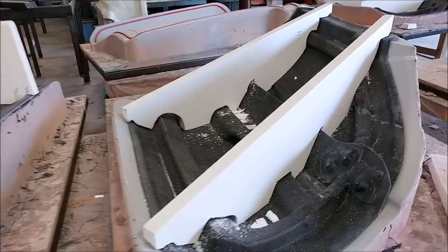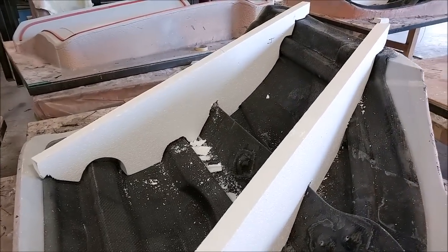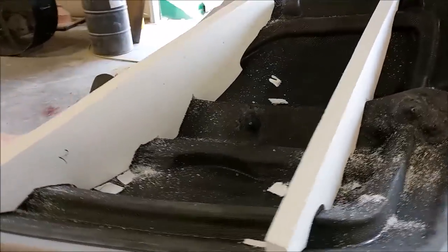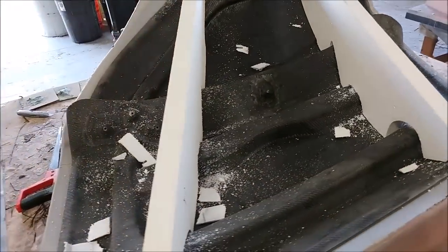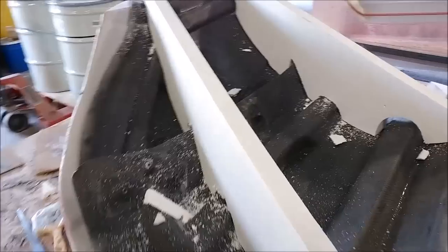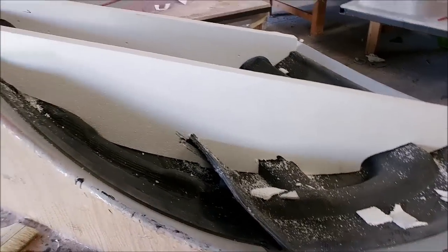Here are the different ones — the doors here ready with those braces that I cut the other day. Those are going to get glassed into place soon, probably with carbon fibre to match the moulds because we want to keep the materials the same. Then that mould will be ready to lay up the door skins.